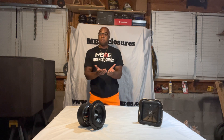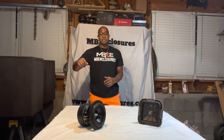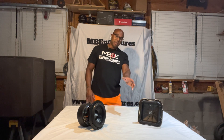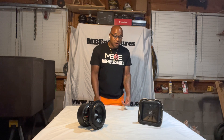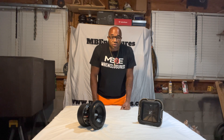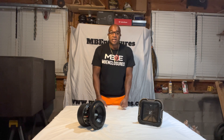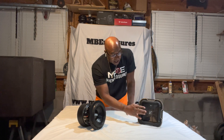With that paper cone, it's just one piece — they use different materials, wood pulp, to stiffen it up, and some put a layer on top of it. Whereas with a polypropylene cone, like the Kicker Q-Class, the cone is not made of paper and it's comprised of three pieces. Just for the cone, it's three pieces put together. This rim structure helps keep it stiff against the pressure exerted upon it.